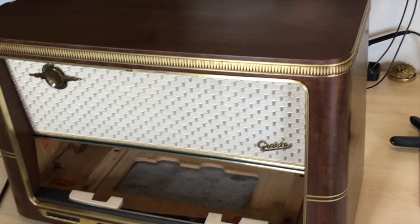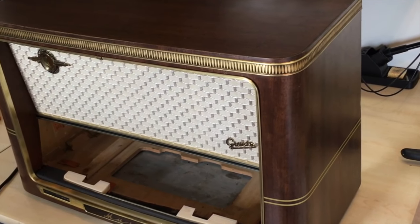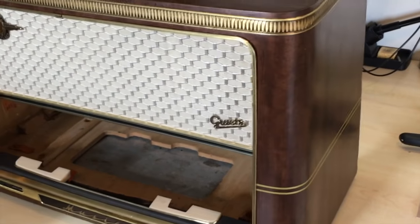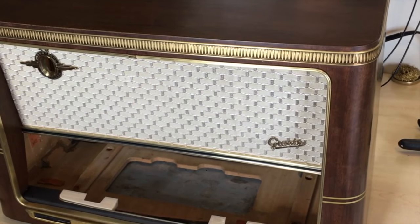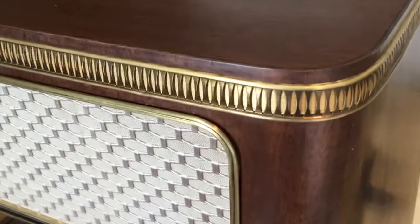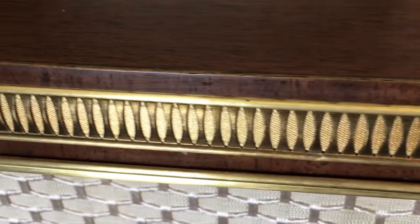All the body work has been done — the painting, or rather the dyeing, the varnish, the gold stripe around the bottom has been put in. This has got several layers of clear varnish over the top. It was then sanded with wet and dry, very fine paper — I think it was 1200 grit. Then came the polishing, and all the polishing and cleaning of the metal parts. This came out quite well. I tried not to be too aggressive so that it retains some of the aged look, the patina.